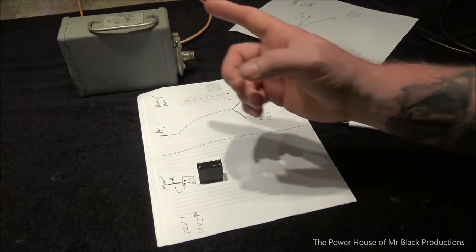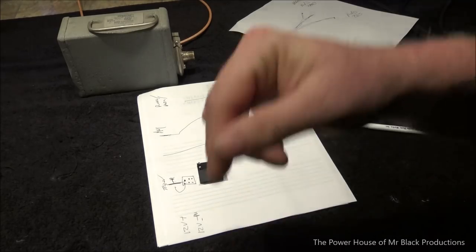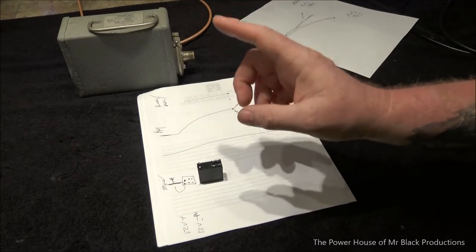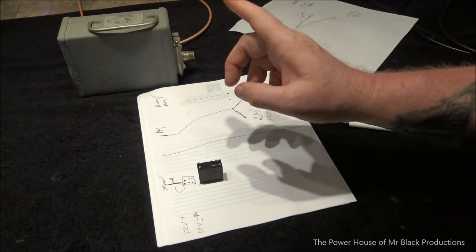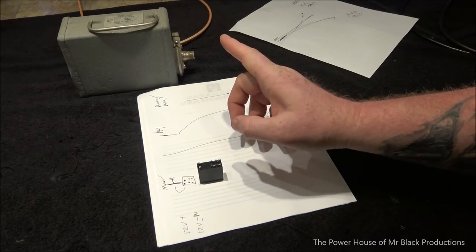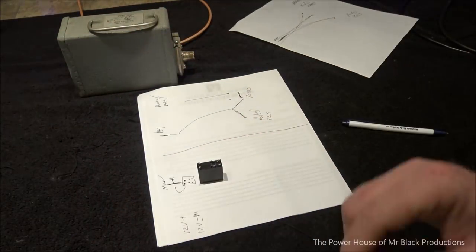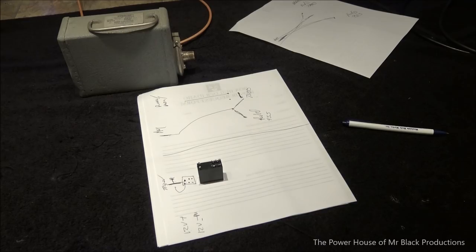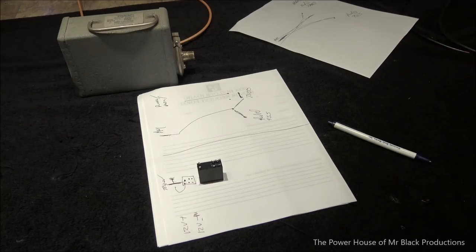Now, in reverse, everything's shutting off, click, click, click, click, click, in sequence. There you're going to capitalize on that delay once again: the radio's got a built-in latency to it where it's assuming it's in transmit mode, so it's going to keep the receiver muted as the transmitter inside the radio shuts down. I explain this to people over the phone and they go cross-eyed. But it works. This system works. It's really super simple. It's just a couple relays, a little 12-volt source, and a couple coax connectors.